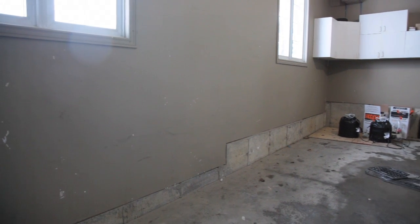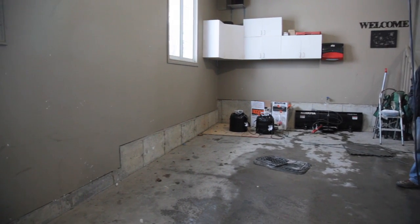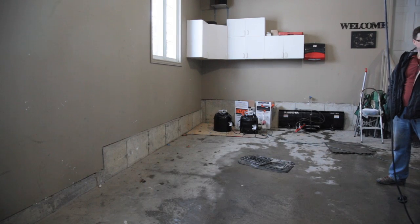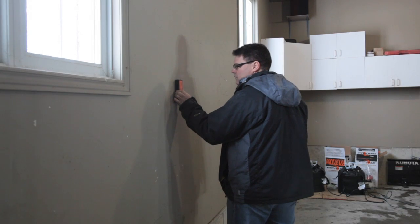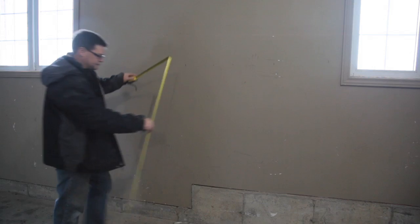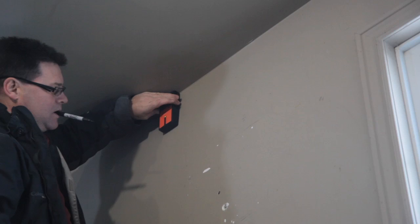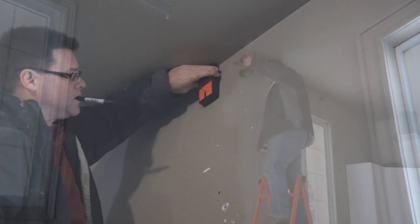This is the inside of the garage we're working on. It's attached to the house, and all the stuff has been moved out of the way to make room for the foam injection work. Begin by using a stud sensor to find and mark stud locations. You'll be drilling one row of injection holes in the space between the middle of each stud cavity at a lower level, and at least one other row up near the ceiling.